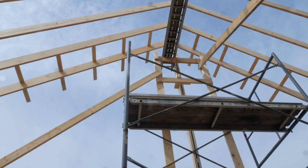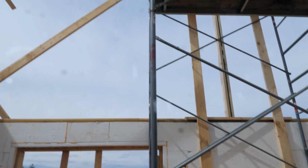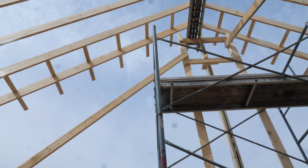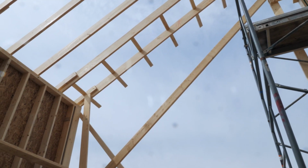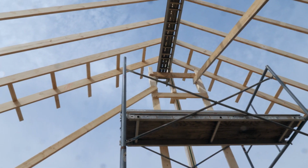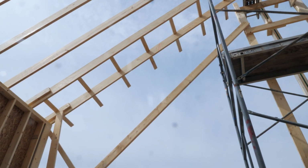It has to be stick framed, and this gable end wall is, I guess they call it balloon framing. Yes, it's balloon framing. That's basically stick building it from there all the way up, instead of platform framing, which we'd normally do. So these are 20-foot 2x10 rafters we're doing for the cathedral ceiling, for insulation. We'll be able to spray foam in those and get our R value.